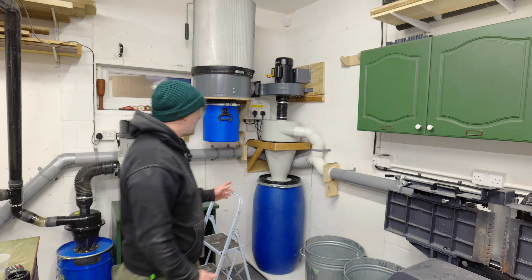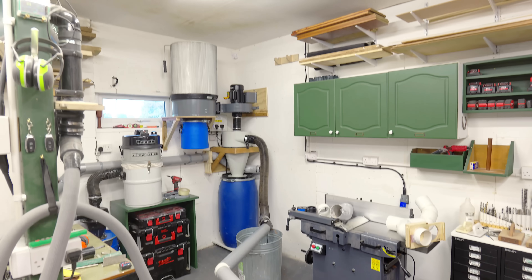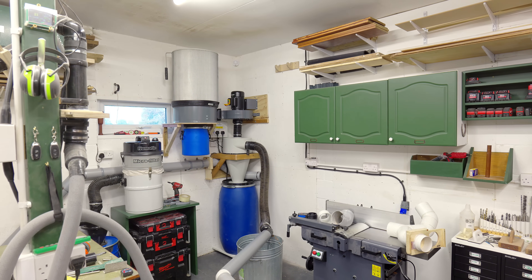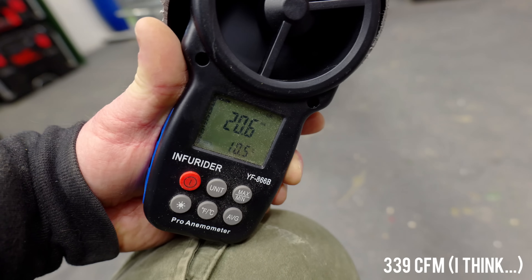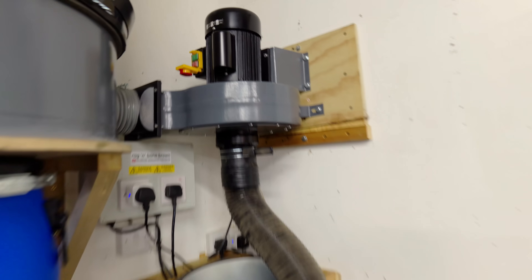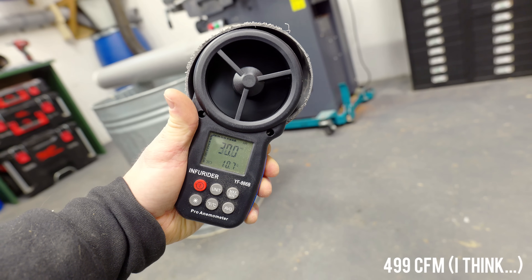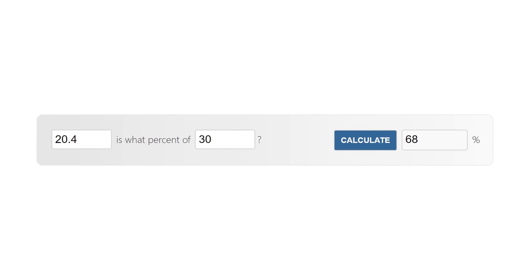I can't help but feel a little bit disappointed by that experiment. I was expecting better results and I do wonder how much of it is down to the loss of airflow caused by adding the cyclone. So I've temporarily rigged up a test so I can measure airflow with the cyclone and then without. With the cyclone hooked up, readings were averaging 20.4 meters per second, and without the cyclone it seems to be averaging around 30, although that seems to be the limit of this anemometer. That is a 32% loss in airflow.